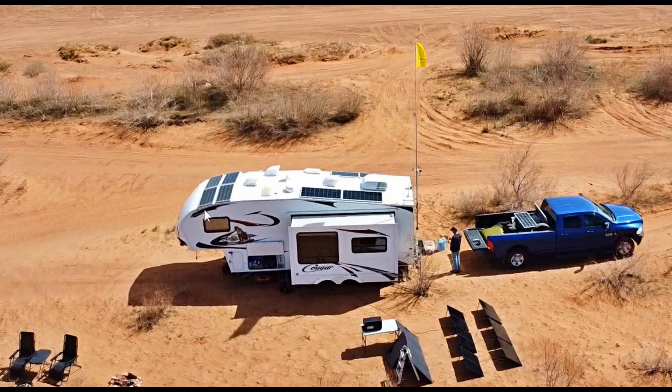On the front controller I can hook up ground panels, and I also have a panel on the back of my truck. On the hitch I have a plug where I can connect extra panels if I want. That's been really handy in mid-winter when the sun angle is very low and the harvest window is short — I lay out ground panels, point them right at the sun, and combine them with the roof panels to get a really good amount of amps into the batteries.